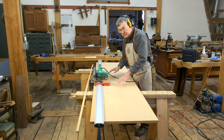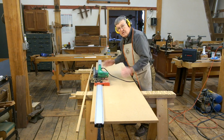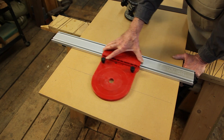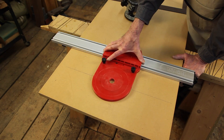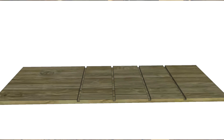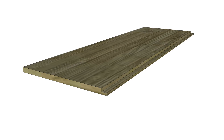For cross-cutting pieces, it's best to set some scrap strips of wood across your horses to support the piece so it can't sag during the cut. The Bora router base also works with all of the tracks and allows you to cut dados, grooves, and rabbets handily with a router. A dado is a U-shaped trough in wood that runs across the grain. A groove is the same trough running with the grain. A rabbet is a trough that's open on one side, making a stair step on the edge of the piece.